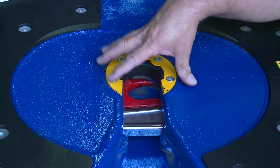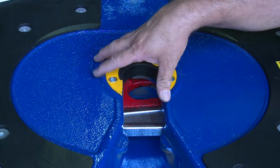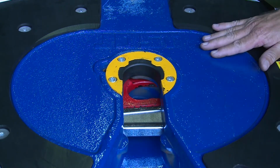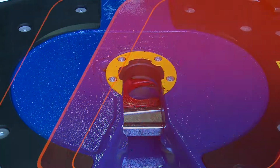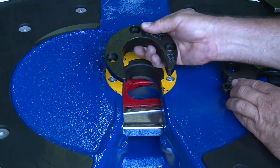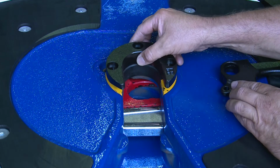That's the fifth wheel fully locked up there at the moment. The lock jaw's in the closed position, the lock bar's gone across behind to hold it shut. Just to show you those components out of the fifth wheel, here we have our wear ring. That's the one that sits in the top.